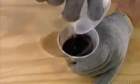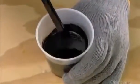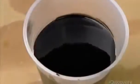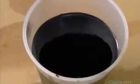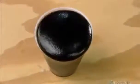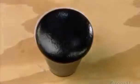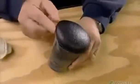This demonstration shows the basis of the next step. When mixed together, these 2 polyurethane chemicals react to each other and produce an expanding foam. By guiding this expansion within the confines of a mold, one can make this dense foam assume a specific shape, such as that of a steering wheel. The process is called reaction injection molding.